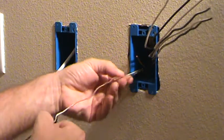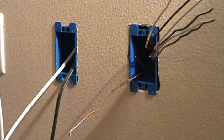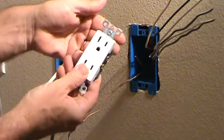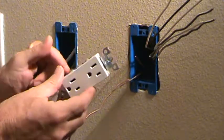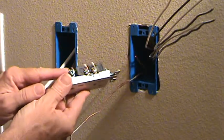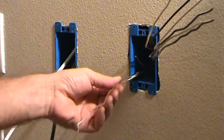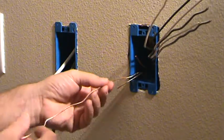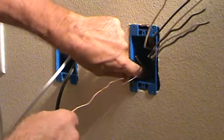What I have to do is connect all three of these ground wires together, because if you remember on the existing plug, we had one ground wire connected to it and there's only one screw for that — the little green screw on the side. So we've got to hook these together.